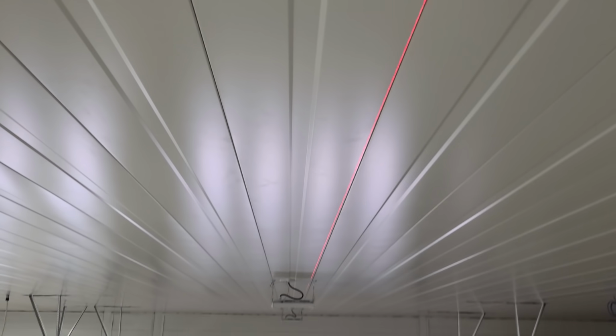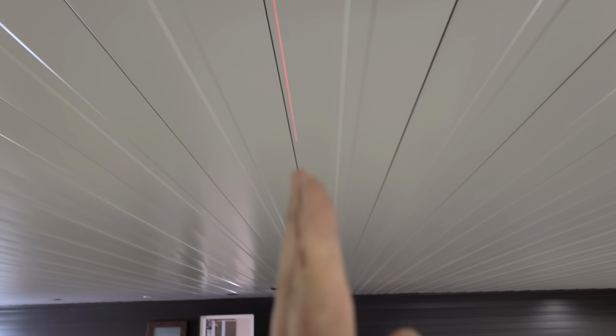One thing I was looking at, the tin here, can you tell? Look at the dog legs, just that 1/2 inch. That laser reveals all. It's on the line there. Oh, I'm kind of in the way, and then it's off the line there. So I have to take that into account when I mount the light, because I was basically just going by the tin because it's straight as heck, right? These long runs. But where they started their next run, it's got just a 1/2 inch difference. So I'll move that light 1/2 inch over so they're all fairly in line.